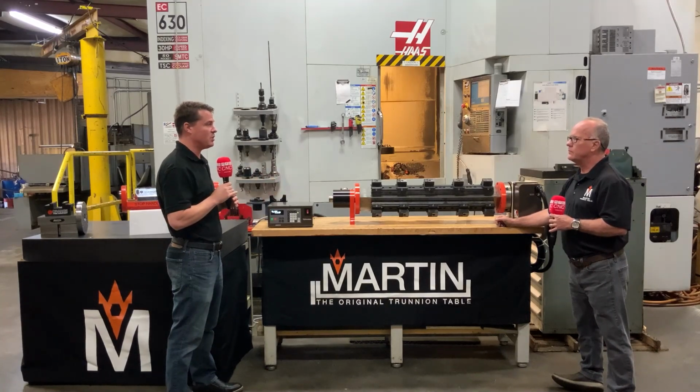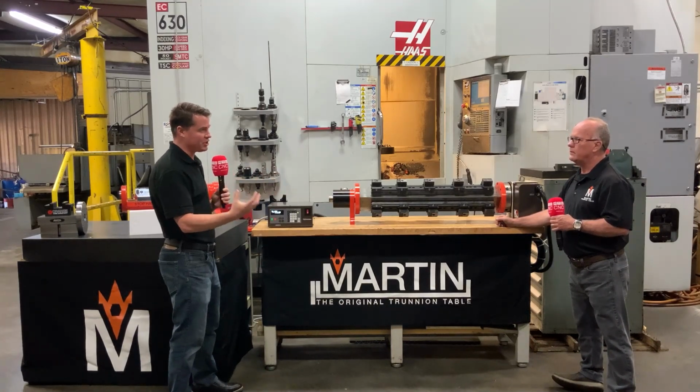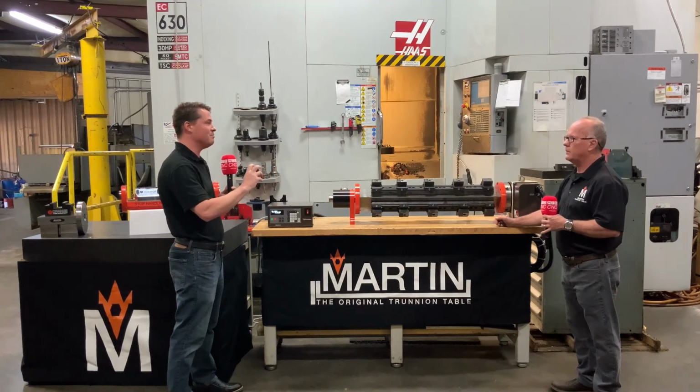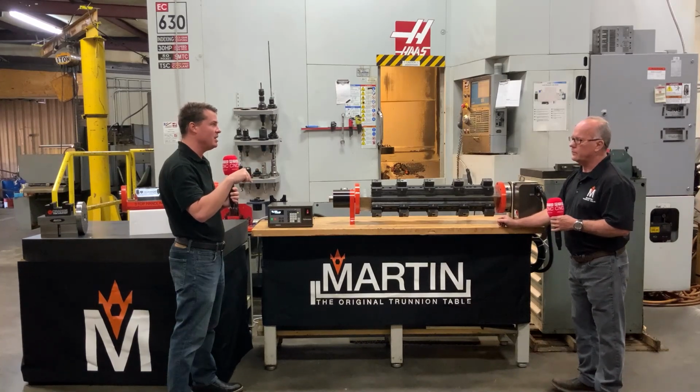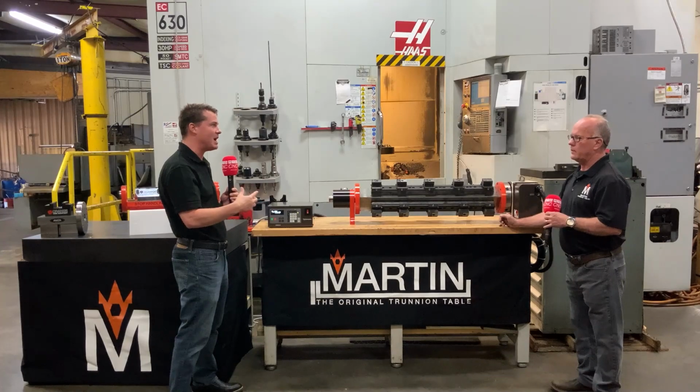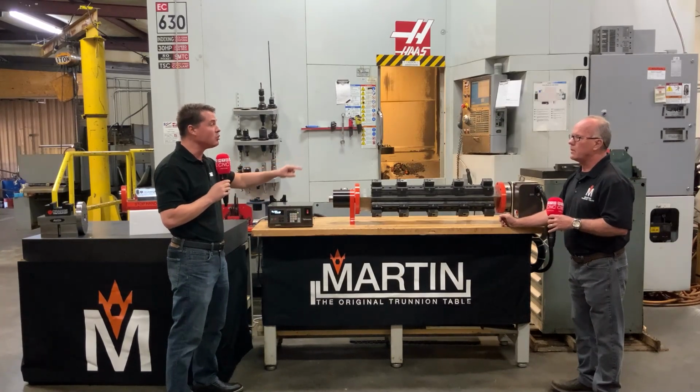What we're doing is we're offering now multiple fixturing from multiple parts that can also rotate to hit more than just that top and that side, whether it be an outside contour or an interpolation from the top or whatever it might be. We're hitting multiple sides now.